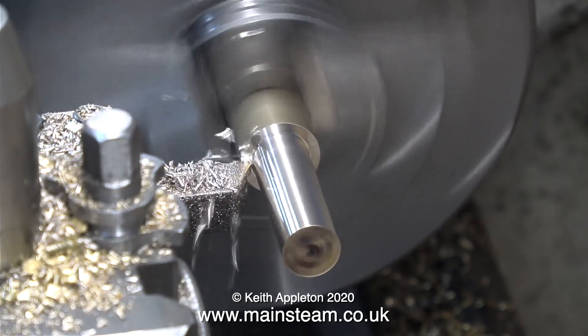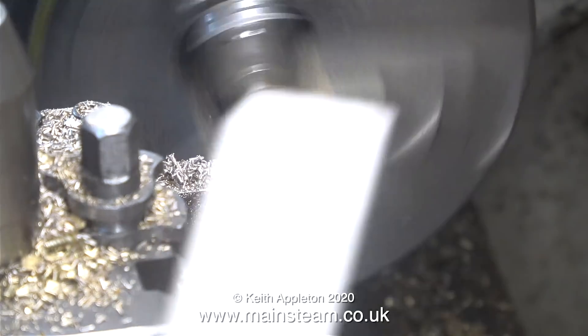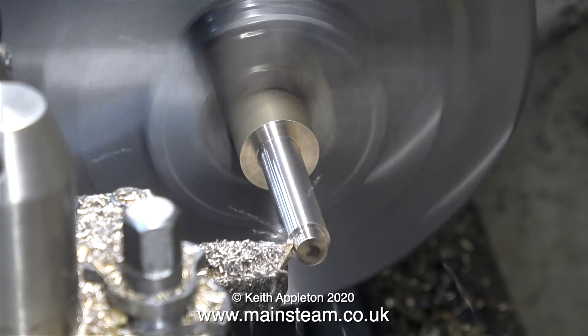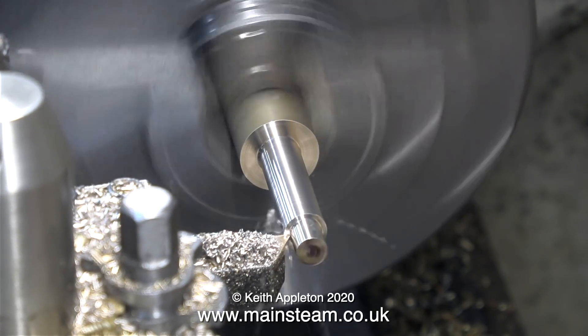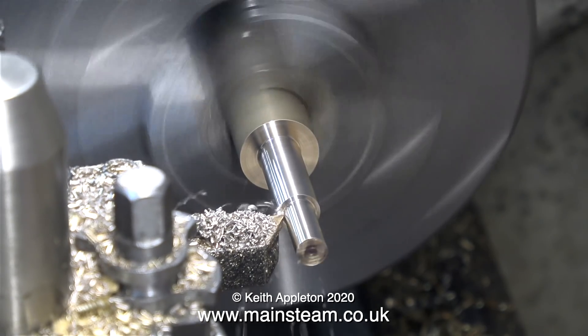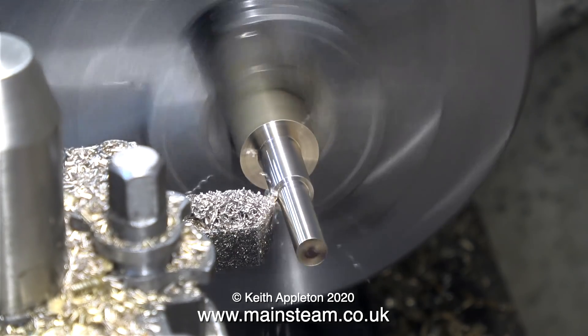To make these bolts a close match to the others, I do not want the red type of phosphor bronze. The one and a half inch point has been reached, so I continued turning and this is actually the last cut of all. It's quite important to make sure that this shaft is turned exactly to a quarter of an inch — not under and not over.